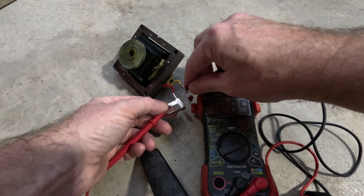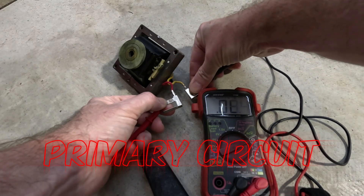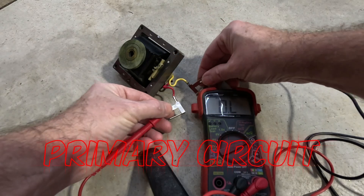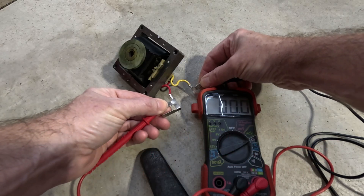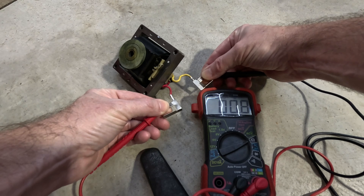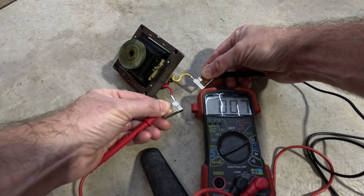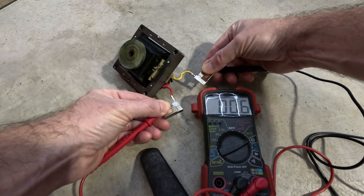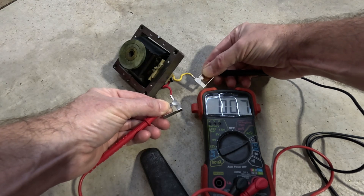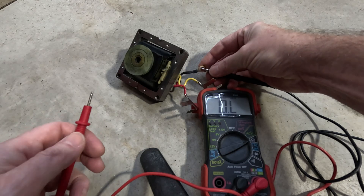...the red one on red, one on yellow — look and see what you got. This should be between 0.6 and 1.5 ohms. Mine is 0.7, so that's barely good, but it is still within the good range.